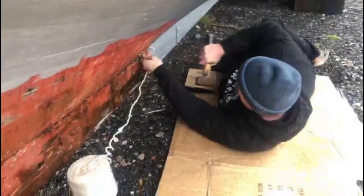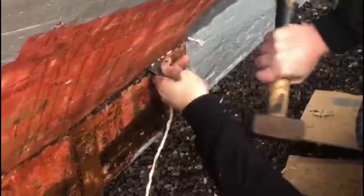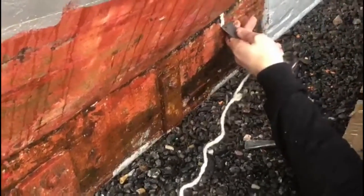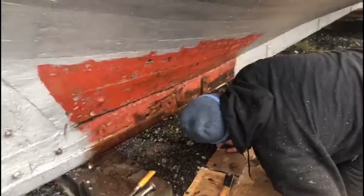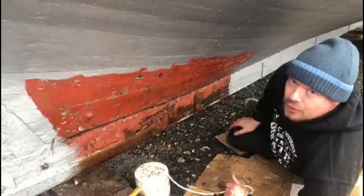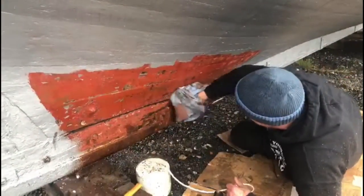Say hello Carl. Hello. What are you doing? This is caulking. In the lovely Cornish summer, in the sunshine. It's raining like a cow pissing on a flat rock. It should float off in a minute. What are you doing Carl? Fixing the leak bay. Well I've just caulked up part of the garboard seam there — it was missing a little bit so we've waxed them in there. Looking a lot drier. Hard to tell in this rain though. In Cornwall we call that a proper job.